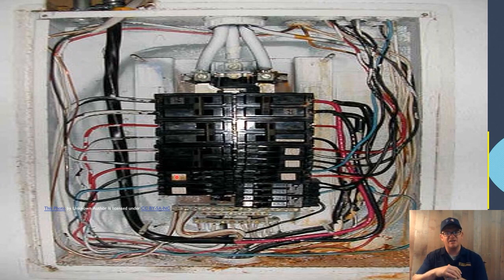Let's talk about some ways we can fix this, but first one more way I've seen: it can ride in on a gutter. A gutter can be leaking, whether this is block or not, running down the wall and running straight into this panel. A lot of times this panel is pressed against the back of the wall. A gutter can be leaking — or a piece of fascia or anything — and water can literally ride down the back of the panel and rot out the whole thing.